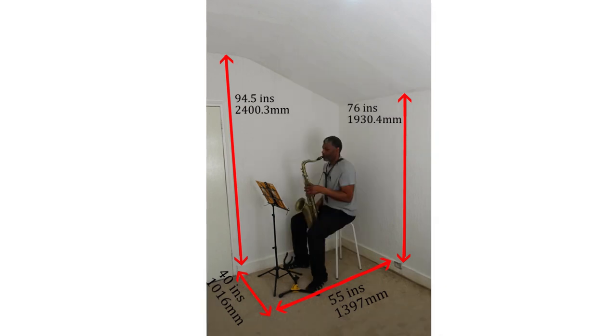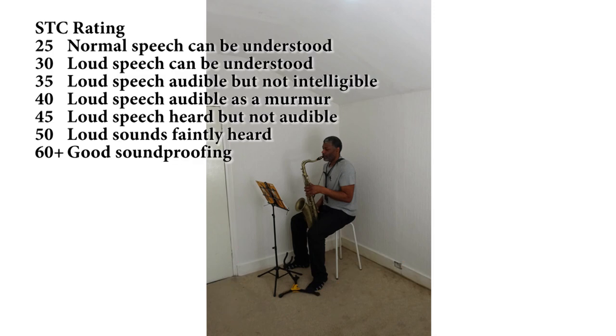I've designed it so I have just enough space to sit with a music stand, which helps cut down on the cost of materials. Ideally I want to build a booth with a sound transmission class rating of 60 or above — that would mean that when the door is closed no sound is heard outside. But I also want it to be cost effective, so I will settle for a lesser rating. I will build it from the outside in, so I can test it as I build it and judge whether I need to add more layers of soundproofing materials.